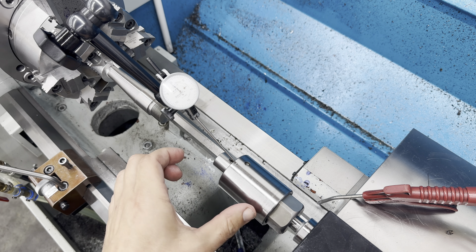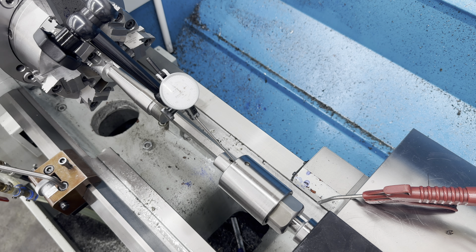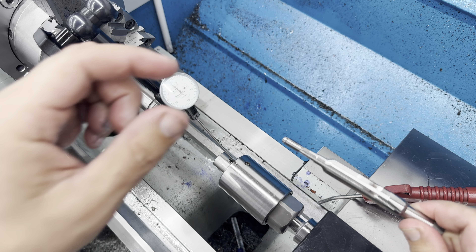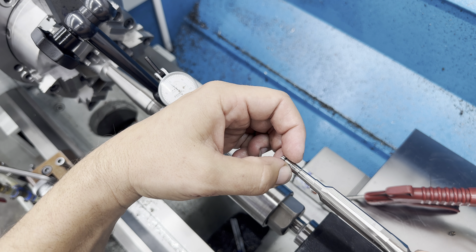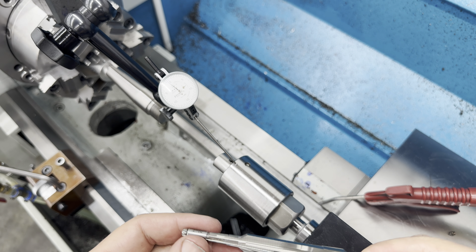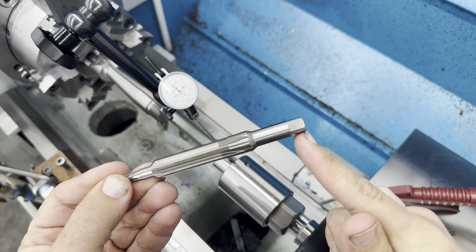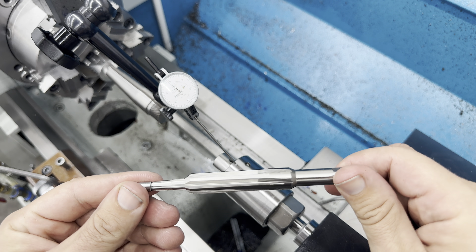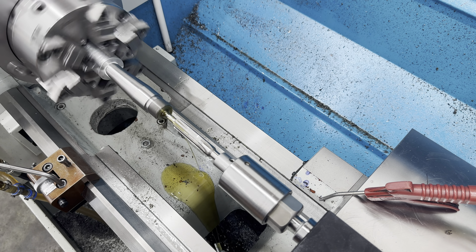What makes me a big fan of this collared system — even after all the cutting and machine work, we're still bouncing on zero. I got the reamer holder indicated to the bore of the machine. This is a floating reamer holder, so if there's any runout whatsoever, this takes care of it. I had to swap out this pilot for one that was a little larger to match the bore. With these pilots set up to match the bore, this guarantees the reamer is going to be tightly fitted and cut perfectly concentric. Some guys use rigid reamers — I don't, because the set screw on 90% of rigid reamers cocks the reamer sideways and that gives you an oblong chamber.